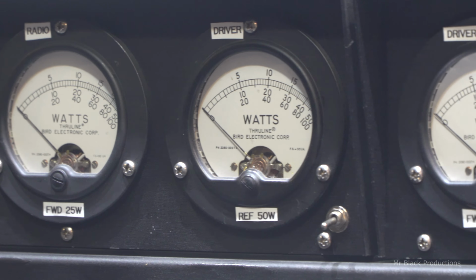So, the thing with super caps is you've got to make sure they're fully charged. Like, you know, we took this out of a fully charged setup, and we got to mount it charged and then hook it to the electrical system. You don't want to ever hook one of these up with no current in them.